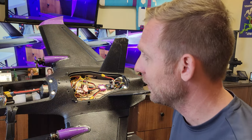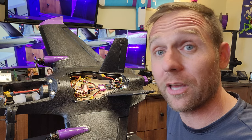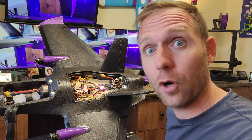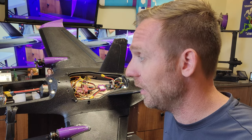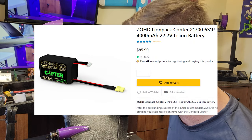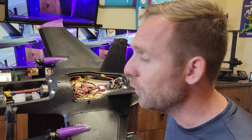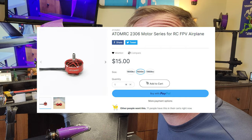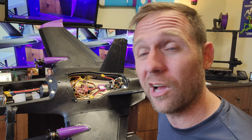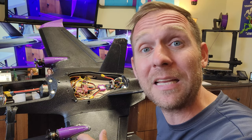Sliding the battery back — we are getting there. My iNav PIDs I didn't change anything, so we're not going to go over that. When we get a nice day I can do an auto-tune and tune this thing — we'll have a third or fourth video for that. What you're going to see next is the 6S battery — remember I designed this setup for 6S. It does work on 4S but it's a high KV motor — the F60 1950 KV. If you want to stay on 4S, I'd possibly suggest the 2306, like the stock motors that come on a Swordfish.